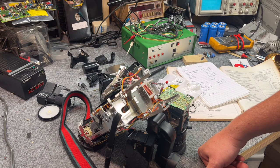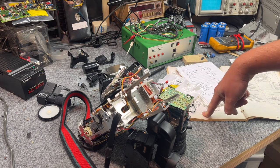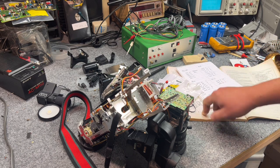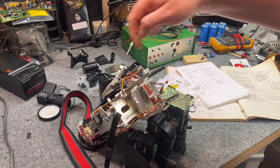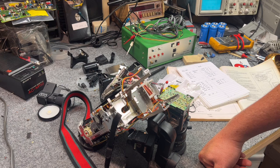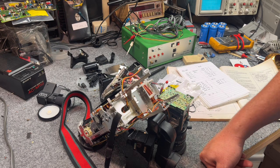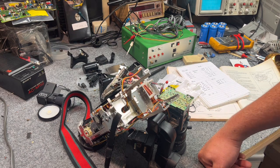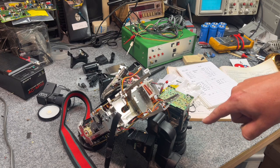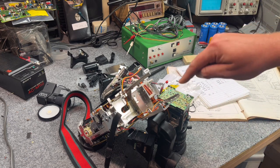I noticed the 5 volts to the drum servo were absent — you'd get maybe 0.3 volts when the camera tried to spin the drum. Using a service manual for a 550, which is all I had on hand, I shotgun-recapped all the bypass electrolytic capacitors on that 5-volt line. I found one that was literally leaking at the bottom, replaced that one and the rest for good measure, and that fixed the drum rotation issue.